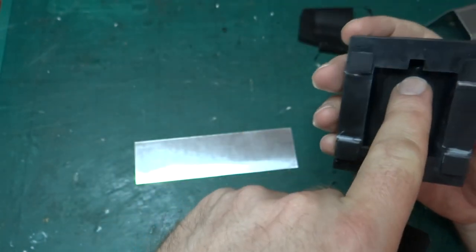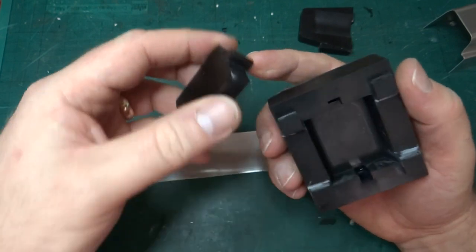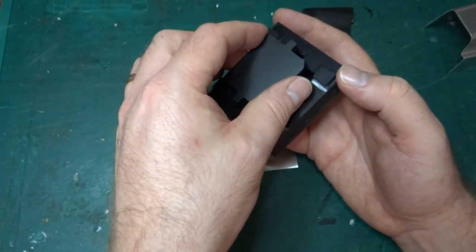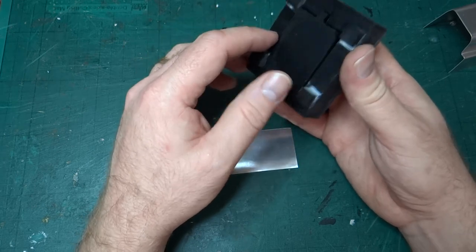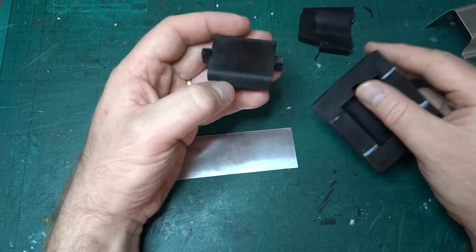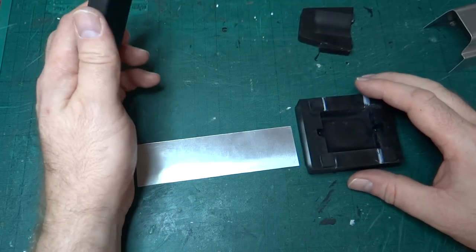But I don't want them bottoming out in the bottom of the hole, so the hole actually continues further down. But I'd made these pins so long that I couldn't actually get the former all the way to the bottom of the hole. In retrospect, I probably could, because there's the 0.5mm of aluminium plate in the way. But I filed them back quite aggressively, and as I say, totally forgot I wanted them to be long enough to engage in the hole to start with.